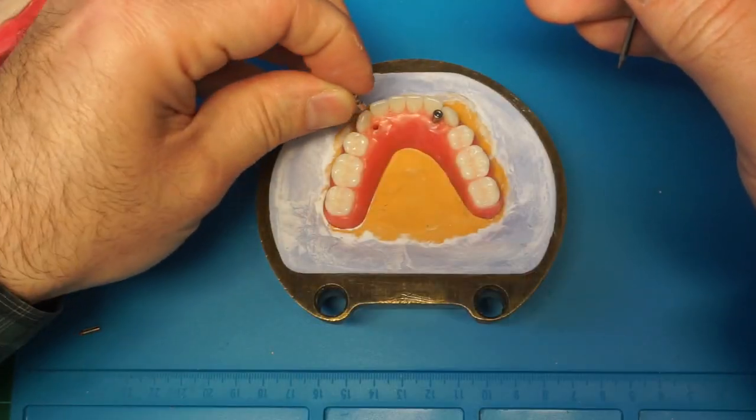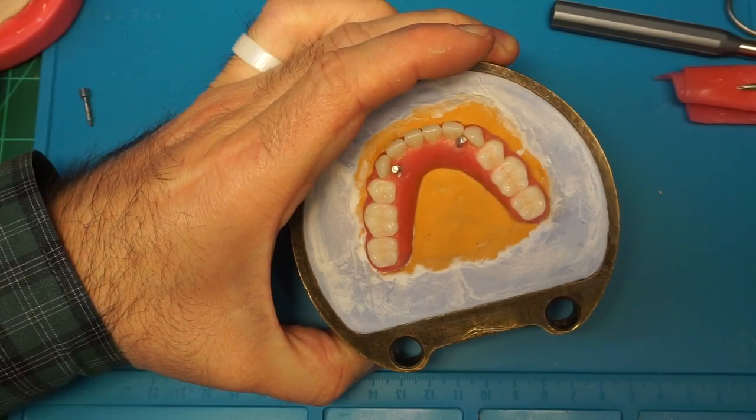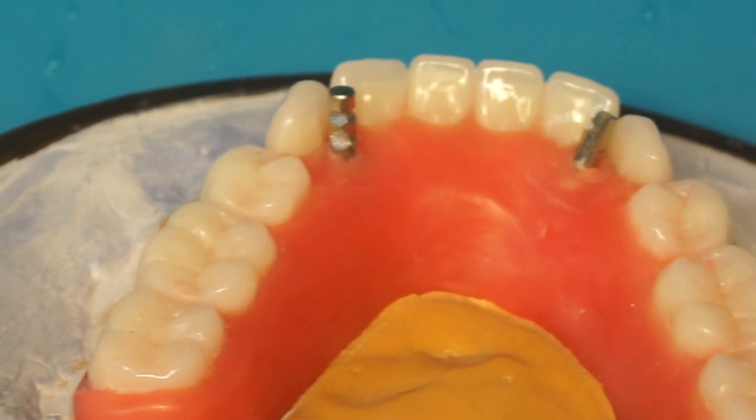Once the stone sets up completely, you have those long pins from when you poured the model. We're going to replace those long pins with regular screws, and just slightly above the bar, we're going to place a couple of cut-down burr shanks — just sitting right on top, not dug all the way down, because you won't be able to close your flask. Those are just position holders. Then take some wax and smooth things out in that area so stone doesn't flow into those places. Double check everything, make sure you've got plenty of room and things are evened out.